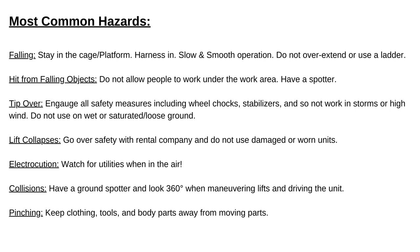A lift collapse — a catastrophic total failure while you're in the air — is why you want a rental company that maintains their equipment. Even if a hydraulic line broke, safety mechanisms prevent it from just dropping. As long as you use it responsibly and as directed, you'll be fine. Also watch out for electrocution: we've built a hoop house where an electrical line ran right over the top. If there's a utility pole nearby, be very aware of overhead cable lines. Have your spotter help watch for those.